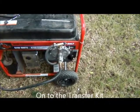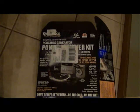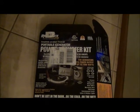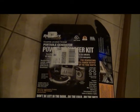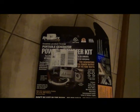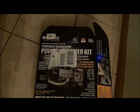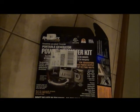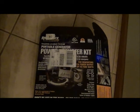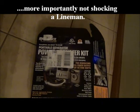I just wanted to give you a better rundown. I was going to do it, but it got super windy as I was filming. What you're looking at right here is my power transfer kit. I'm going to hook this kit up to my power so that six of my rooms in my house will be powered by the generator, and I'll flip the switches on and off as I need them. You need one of these legally, especially in this state, in order to run a generator into your house without getting sued or whatever. There's a whole story on that.